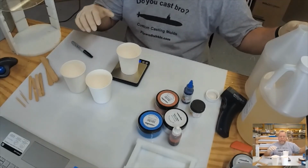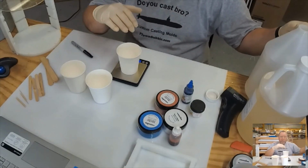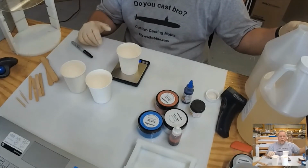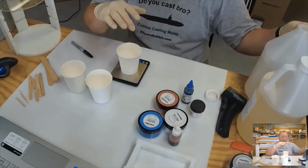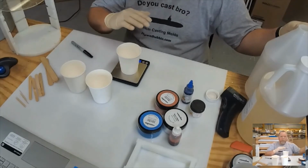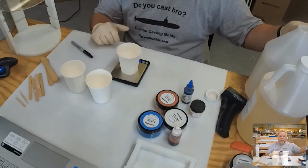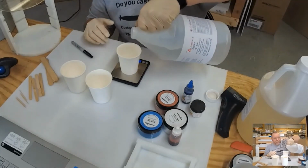So I need 300 for the cast. I'm doing 3 colors. So a little bit of math, that means I need 100 of each color if I want it all mixed evenly, and that's all I'm going to do today. So to get 100 white, 100 blue, and 100 red, but this is a 2-part resin because it's Alumilite clear. So I need 50 of part A and 50 of part B to give me 100 of each color. So again, measuring in grams.